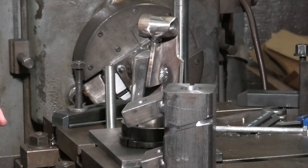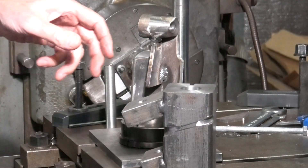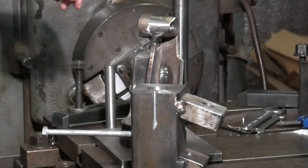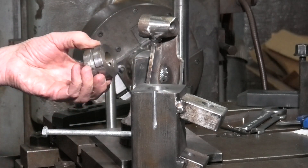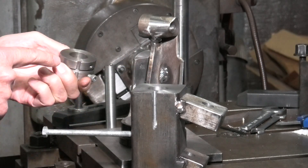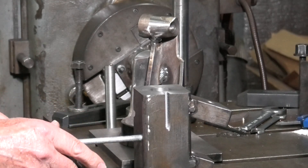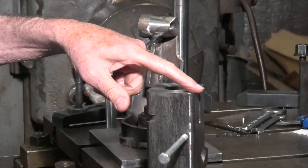Now it comes down fairly well — I get probably 30 degrees below horizontal, which means the front foot will sweep up quite well. That's a look at the slot that the latching plate will run in. I think the slots in the indexing disc are a little bit narrower than that, and I can't remember how I set up to machine those slots, so I might just grind down the front of the latching plate — it's only going to be a bit of 6mm plate, no biggie. The next job is machining a fair bit of this face away.